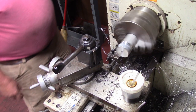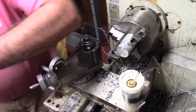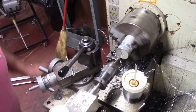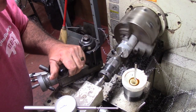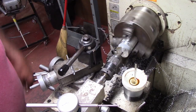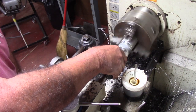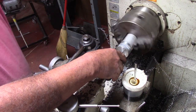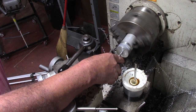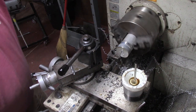Let me cut this off. Put it in at slow speed. We'll power tap it right quick. I already tapped this hole, but unfortunately it just wasn't deep enough. So we're going to run back in there and just run it a little deeper to make sure we're going to clear. We want the stud to clear through on this so that he can always cut the shaft to whatever length he needs.